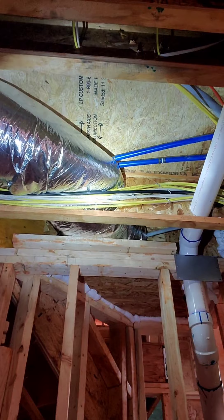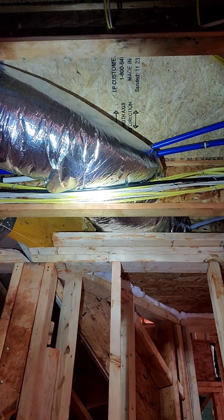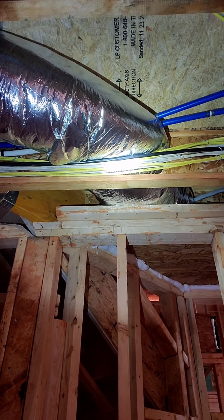That will inevitably kill a compressor if you don't have good airflow coming back to the system over time. Customers are wanting to know why this compressor is going out, why their unit is not operating properly after the first year. And your home is out of warranty after that first year, so it will be on you to get that system repaired.